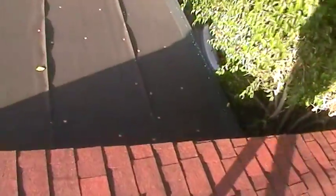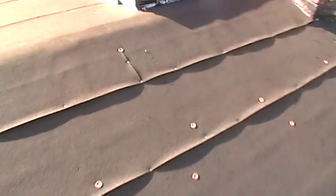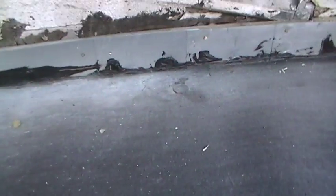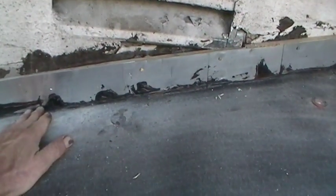I'm going to do this part, and then the front of the house will be done. This section already has the starter row around it, and I've got my metal flashing right here for around the fireplace — and that little section right there. I got more flashing for this because I actually made a mistake. I put my flashing underneath the paper. You're supposed to do shingle, flash, shingle, flash, shingle, flash — and I misunderstood and put it all under. In one regard it's okay because it built up this edge so it actually has a little more pitch. But anyway, I got new ones and I'm going to place them as I go with the shingles.